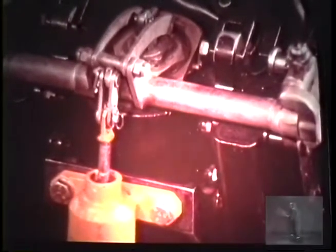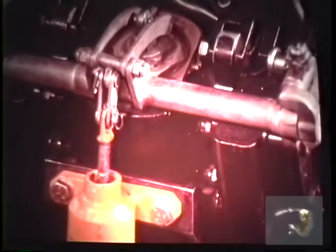If the rotation were to continue, the banana links would pull the sear, which would fire the catapult gun, but rotation is stopped at this point by the canopy interlock block. This is to assure that the seat won't eject before the canopy is jettisoned. When the firing pin is pulled from the seat-mounted initiator, however, it fires, instantaneously sending gas pressure throughout the emergency escape sequencing system. This causes the gas-powered inertia reel to retract the occupant's restraint harness and lock his upper torso in position for the ejection.